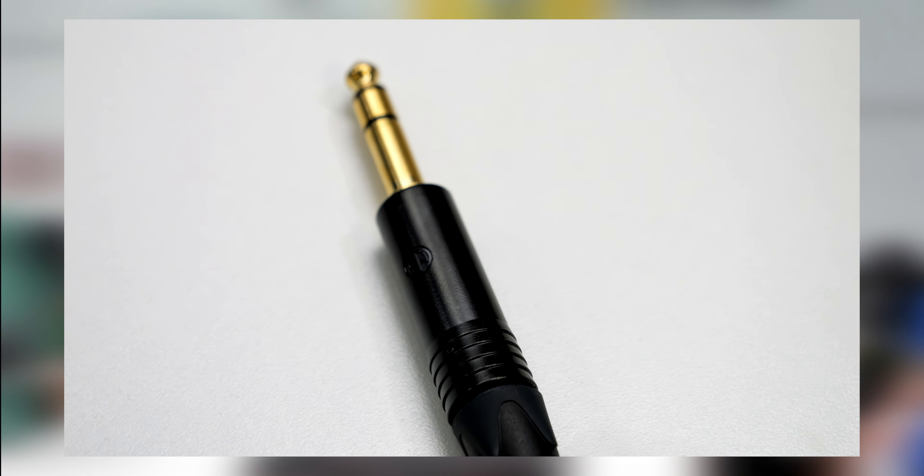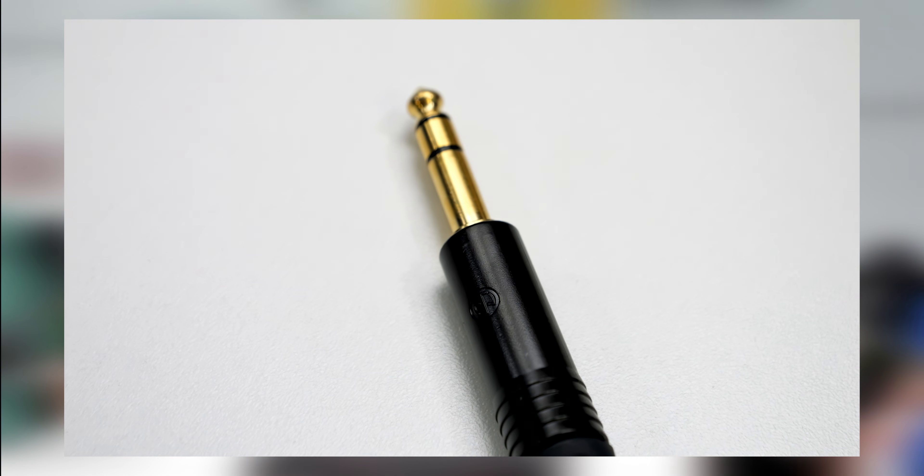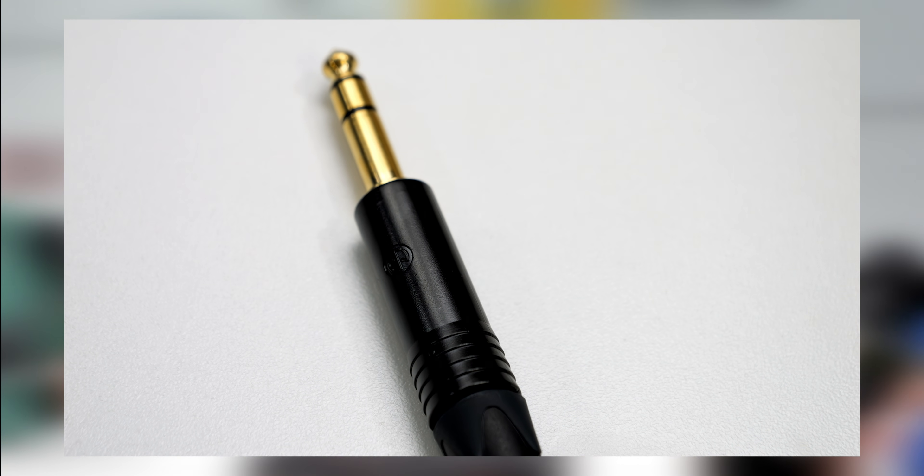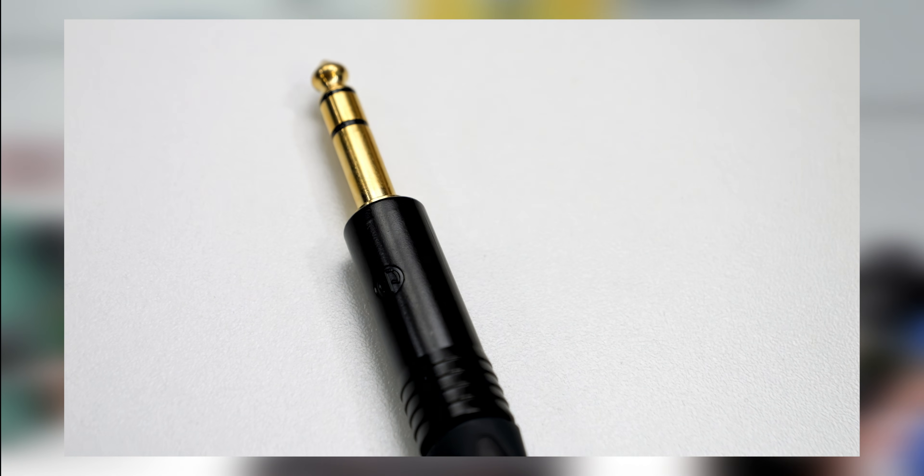Let's try to narrow this down by the plug on the end of the cable, because it might help people understand. When you look at the plug, count the rings — there are black spacers between the metallic sections, and every black spacer is separating one wire from the next. For example, these two connectors on screen — it's a quarter-inch connector. It has three separate areas where you can connect a wire. That means it can only handle three wires. One is ground, which is common to both left and right, so left and right share one wire. Then you have two other leads — one for the left, one for the right. So three. That connector type can never be balanced.